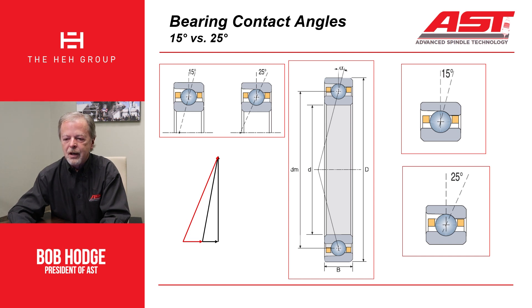For the most part, we're looking at 15-degree and 25-degree contact angles. The reason this is important is that the 25-degree contact angle bearings will carry a heavier axial load — they have more axial capacity, but that's at the sacrifice of some radial capacity. The 15-degree has less axial capacity and more radial capacity and stiffness. In this diagram, what you see in black represents the vectors — the axial and radial vectors for a 15-degree bearing. Superimposed in red, you see substantially more axial capacity in the 25-degree than the 15-degree.